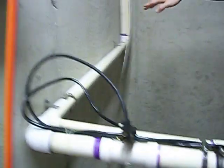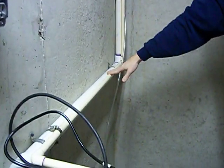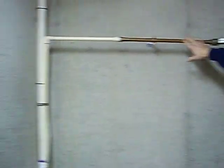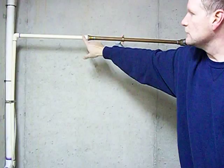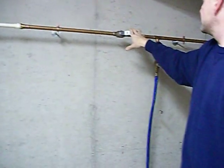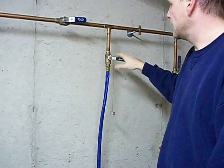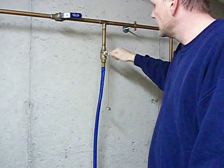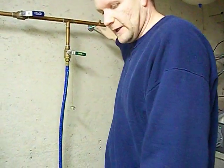I piped it back here to where it goes out the house and then down into a ditch. And here is the CPVC for the water supply for the backup system — it comes up to here. I soldered it up here, put a female adapter on and then just ran with a male adapter back out. I put a valve into my domestic water line coming in. This is just a line I put in to fill up my hot tub that we have down here, and that ties right into the house system right there.